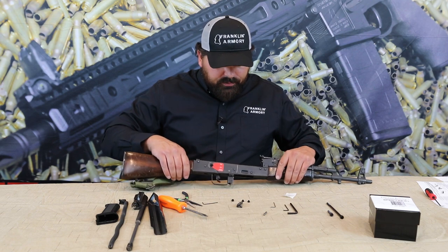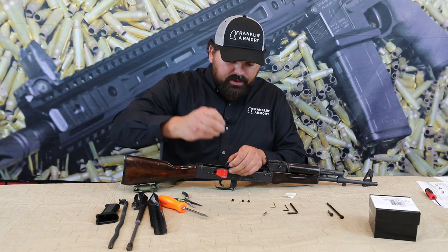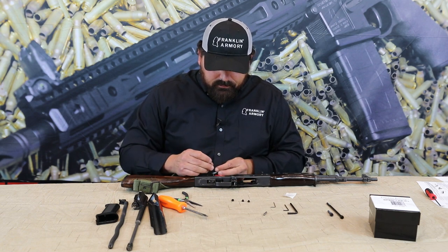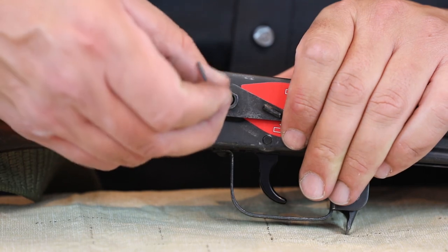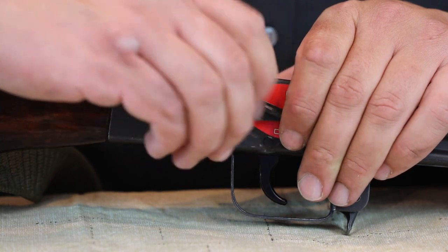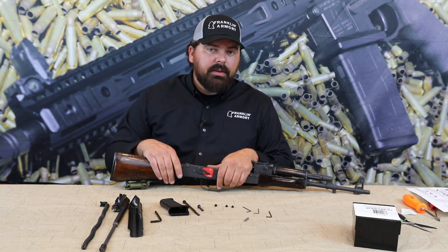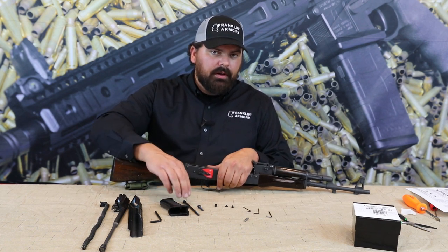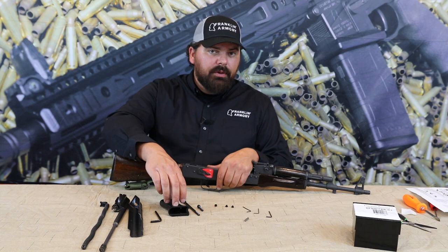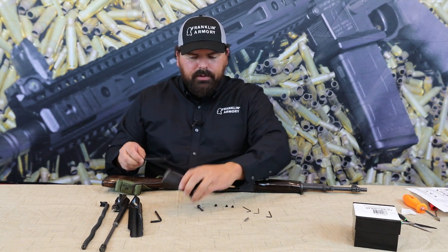The red sticker goes right along the edge of your safety selector hole. Once your sticker is in place, go ahead and install your safety selector — you'll need your 1/16th allen key for this process. With your safety selector installed, we're ready to move on to installing your pistol grip and pistol grip screw. Your kit comes with a long screw and a short screw; depending on the type of pistol grip you have will determine which one you use. This AK uses the long screw, and your screw will actually thread into the bottom of your trigger housing.